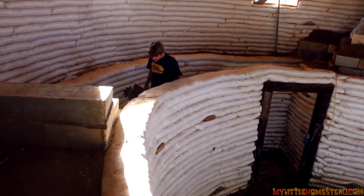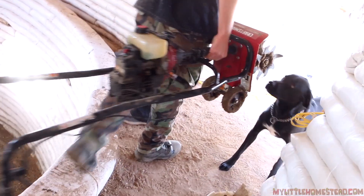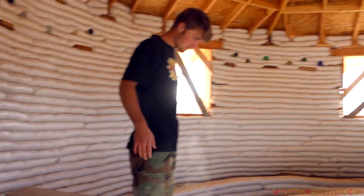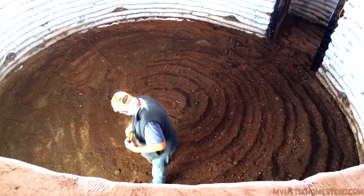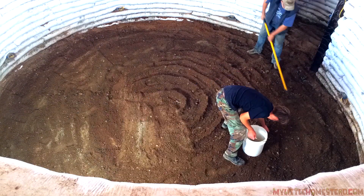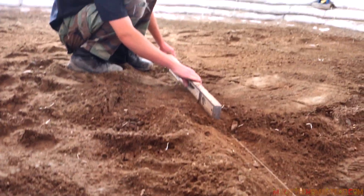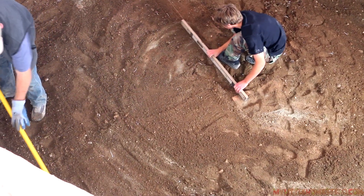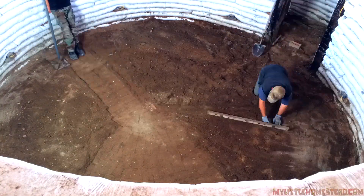We call that done, eh? Now we've got to focus on leveling it. I'm just trying to get the big rocks out here - if you want to come help pick out the big rocks. I'm just resetting this. The brick is the important part. And then when we're all done, we level it again, and then we tamp it.